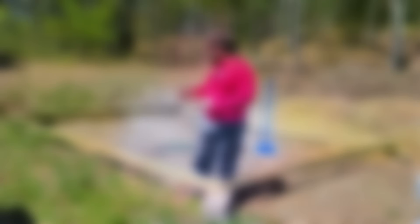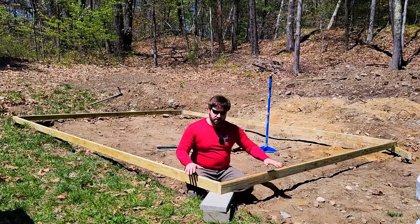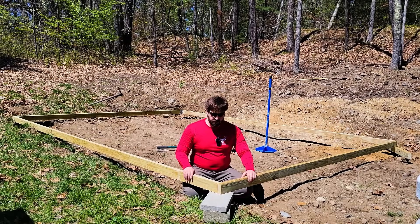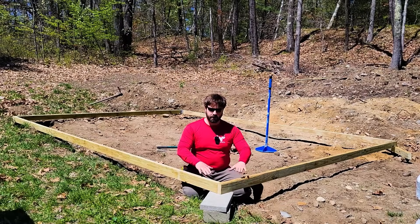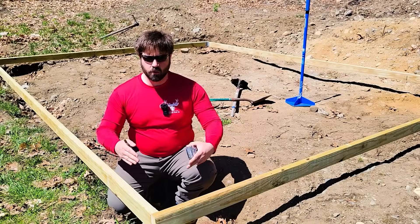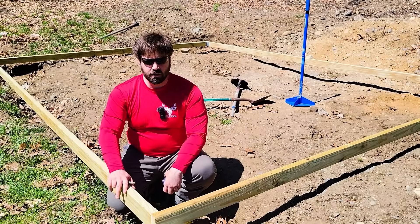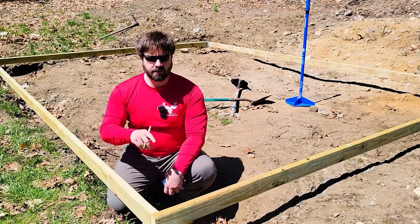I want to make sure that they're all in line with each other. So we're ready to start the construction process. This is going to give me a layout of where I'm going to put the foundation pieces, and this is also going to let me level to this point for the foundation. We're going to be pouring the foundation here shortly, but in the meantime I've got to do a little bit more digging out - we don't want the foundation sticking out beyond the structure. The structure itself is going to be 12 by 16, because that keeps us under the 200 square foot limit for my town.